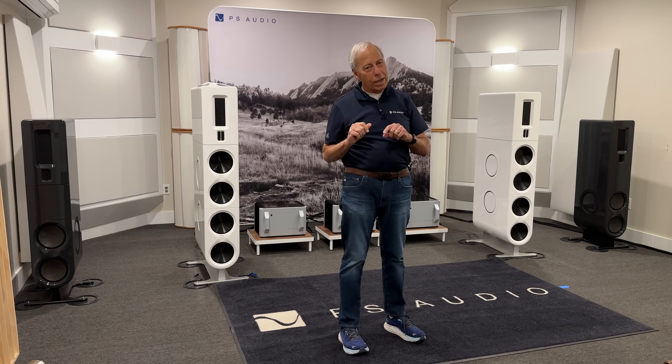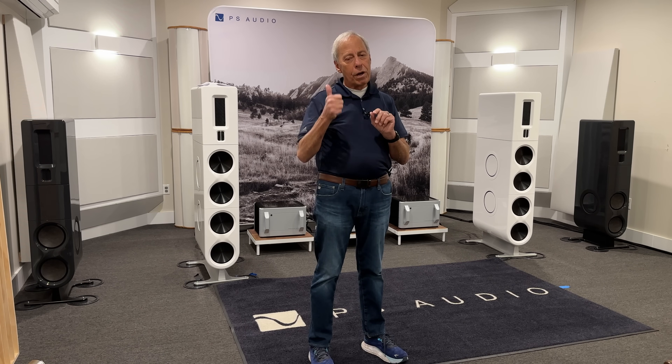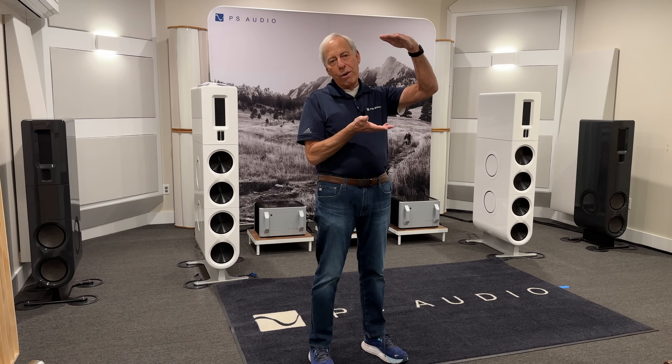But we're tricky. We take a small film capacitor — you can't put low frequencies through this 0.1 cap, but high frequencies go through it all day long. So that sandwich of a big cap that can handle low frequencies and a little cap in parallel gives you this spectacular bandwidth, and it sounds so much better and open.